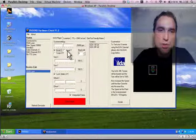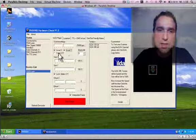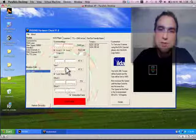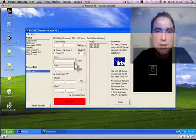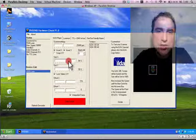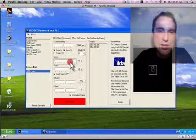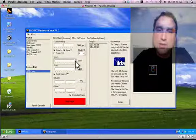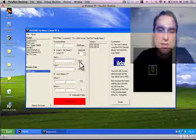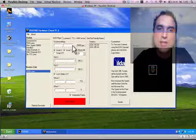Furthermore, you can invert, of course, the display itself. You can swap XY, you can reduce the sizes and give another offset to the scanner. But the ILDA test pattern doesn't work if you reduce the size to another size. So you must have always, for the test picture itself, the 100% size to get the real scanner settings output.